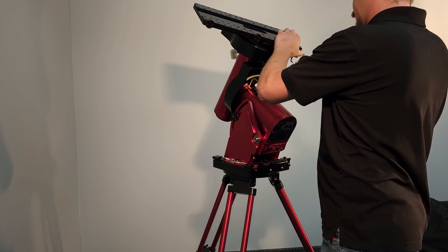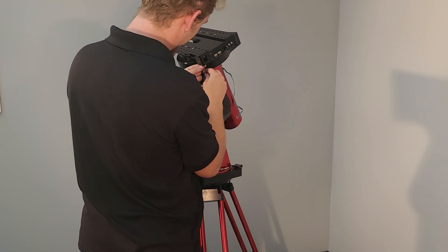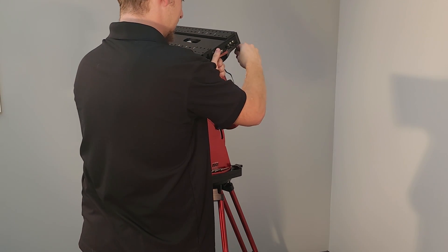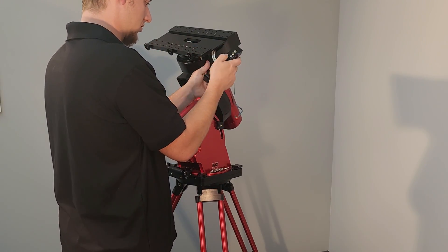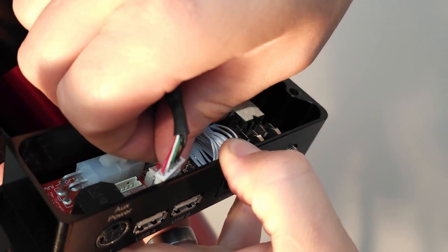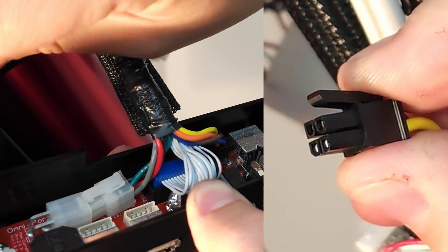From here, move to the instrument panel. Two screws underneath the panel can be removed using a 5/32 wrench. Pull the instrument panel away from the VersaPlate. Remove the loom and disconnect the through-mount cables starting with USB, then the white connector, black connector, and finally the ribbon cable.